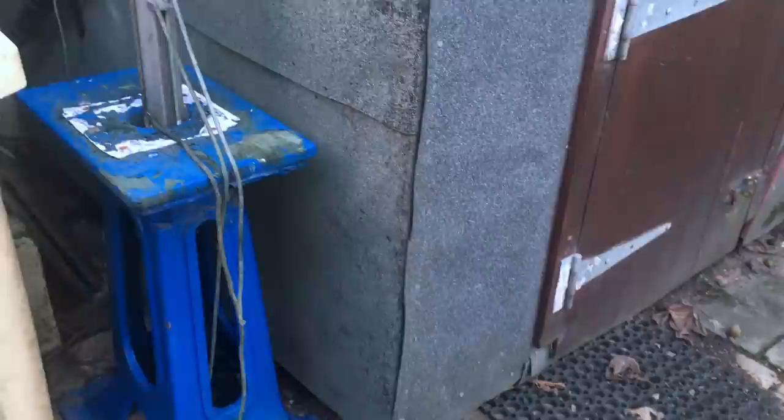The next weak spot is the walls, and these are very often overlooked. It doesn't matter just how secure your door or window is if the criminal could just pull the siding off and climb through the resulting hole. Criminals aren't going to be careful — they will smash their way in, smash and grab, and cause a great deal of damage. I've got two methods employed. The first incorporates weather resistance: I screwed a sheet of thin plywood over the top of all of the clapboard siding, then used roofing felt over the ends to protect them from prevailing wind and moisture. That means it's just impossible to pull it all off.